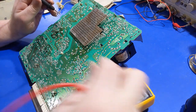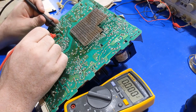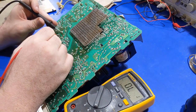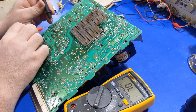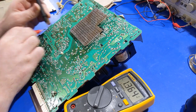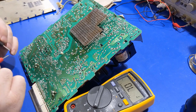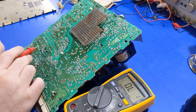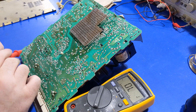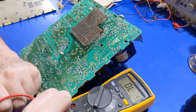Let's check the primary side. First thing I want to do is make sure the capacitor is not charged — which is here and here. Not shorted. Check this MOSFET — it's good. Let's check this MOSFET — it's good. So for all intents and purposes this power supply should run. Where the burning smell is coming from is definitely not from the power supply section, unless something was hard shorted somewhere else.